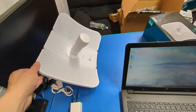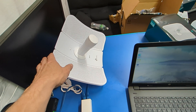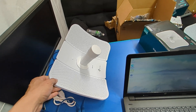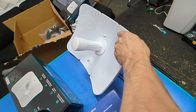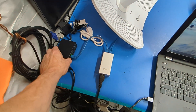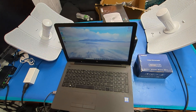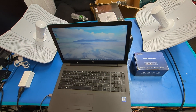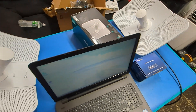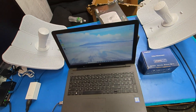This guy is all configured as an access point. When deployed on site, this one will be fed off the main router in the main house, then it will feed the client-mode unit, which will eventually feed the switch in Jeffy's house. Basically, Jeffy built a tiny house on the same property as his parents and wants to link both houses so they have access to his NAS — which is why he wanted close to gigabit speed between the two buildings.